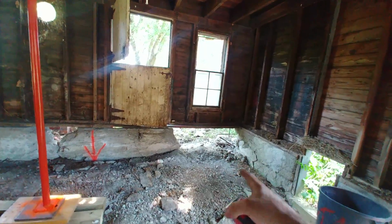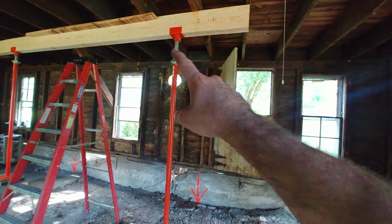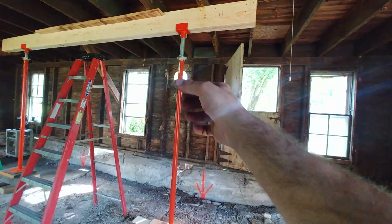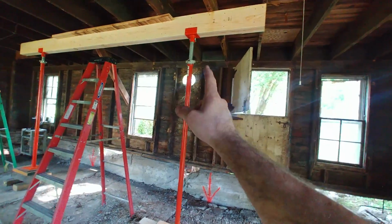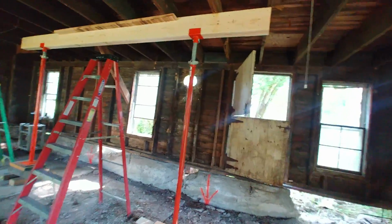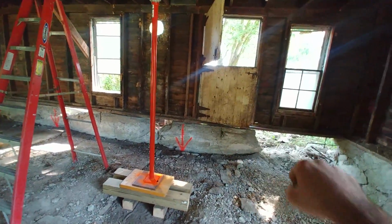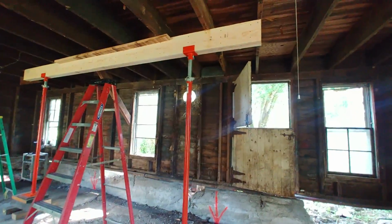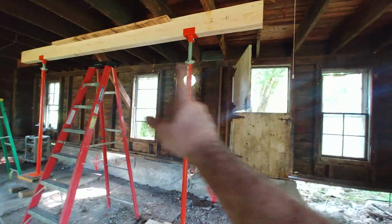The reason I'm using these lifting shores is because they're like a screw jack. There's a physical heavy-duty thread here, and under no circumstances will that compress in. And the carriage that you turn has thrust bearings to make turning it, and the engagement on that thread, the friction, a lot easier. Because with a conventional screw jack, you kind of have to throw your whole body weight into a real long bar to get the leverage to turn it, and you don't want to be forcing anything really hard. You want to be real smooth with all the action.